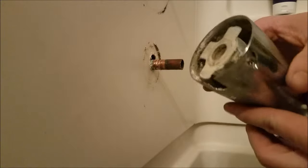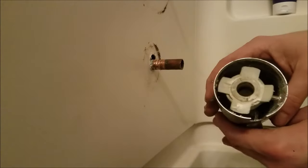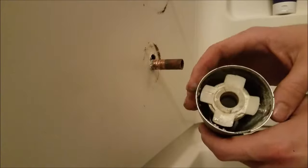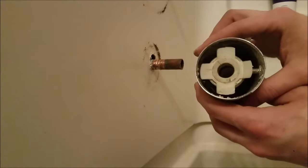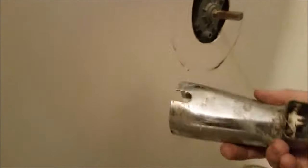Alright, there you have it. Now you can get a good visual representation of what exactly happened here. What I presume happened was that somebody at some point tried to remove this by twisting it and the centerpiece spun — or actually the centerpiece probably stayed in place and the outside spun, and then they tried to spin it back but the centerpiece moved. You can see right here in the shiny part of the copper that this has been spun multiple times enough to actually create a groove in here. By spinning it and tugging on it you can certainly break this pipe, which is not good.